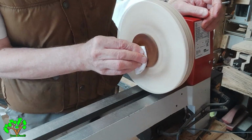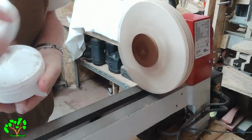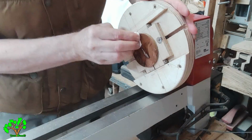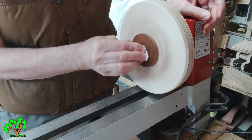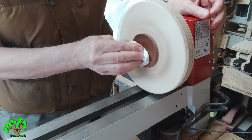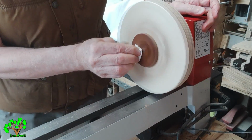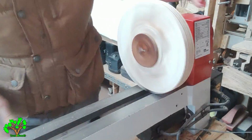I enjoy using Yorkshire Grit abrasive paste. It's almost like a polish. It darkens the wood somewhat, but it leaves a very shiny finish and one's tempted to just leave it as it is. But I put sanding sealer on and two coats of melamine, just to be sure.